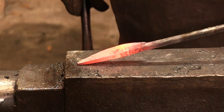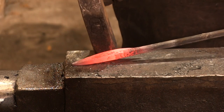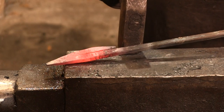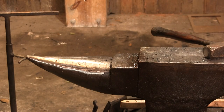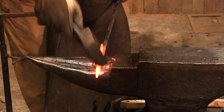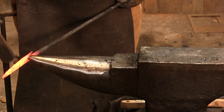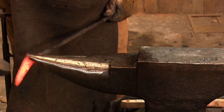And something like this is what you want to end up with. Now we'll take one more heat and come over to the horn of our anvil — over the horn we're going to roll this guy down and at the same time pull this one up. It's going to be a pretty cool little S shape. Here we go — see how that spur begins to lift. Then hopefully I've got enough purchase to get right up under here.